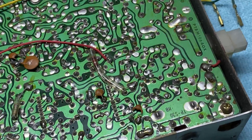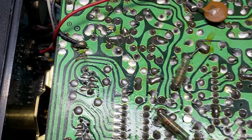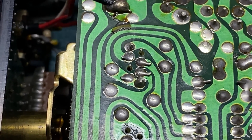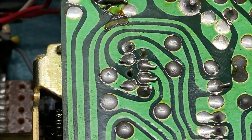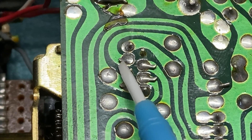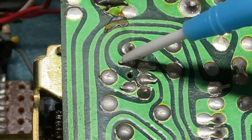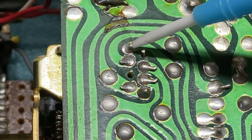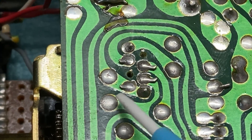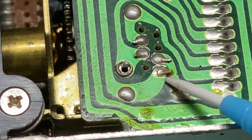Just as you'd expect from one of these boards, it's a 106 AOX board. Doing a visual inspection, we can definitely see a cold solder joint on the channel change - that's not going to help matters, it's definitely flapping about in the breeze. There's another one there as well, so those will have to be dealt with. To be honest most of them look dry, so we'll re-solder the whole lot.